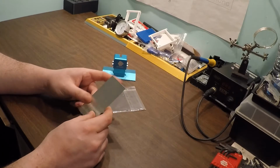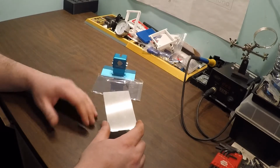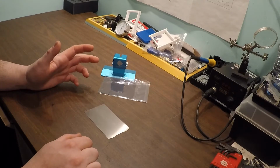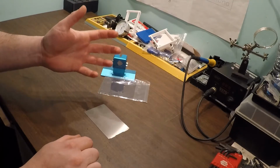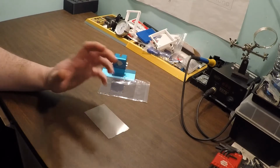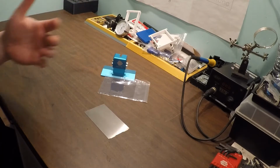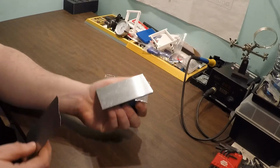And what you do is you literally super glue the two pieces together. So tape to tape, you put super glue, spread it out nice and thin, apply it, put some weight on it, and literally let it sit overnight. This thing will not move. It's a great trick. You can do it with thick chunks of aluminum, basically whatever. It's really a neat trick, something I learned a while ago, and it just takes so much time, and I just wanted to get it done. So anyway, it's done. So this is it.